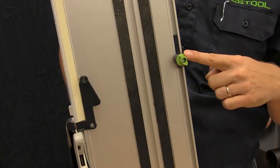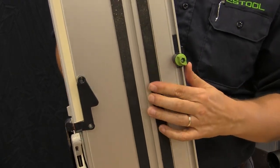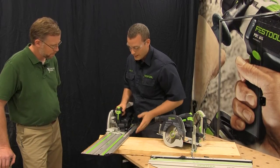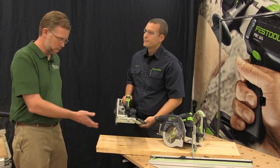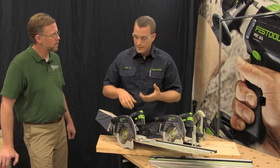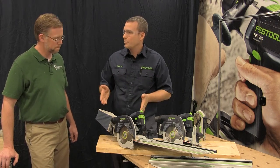The cool part is what's underneath here — we have these two stopping points. This one's fully adjustable. I can set this based on my miter scale for a particular cut, tighten it up, bump my two points in, and then I'm ready to make the cut straight across. So if you're cross-cutting framing lumber of pretty much any size, you can lock it right into the angle you want and just make cut after cut after cut, without all that time with the square doing layout and measuring. You know you're going to hit that same angle every time.